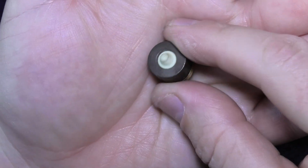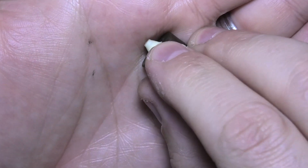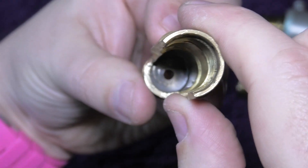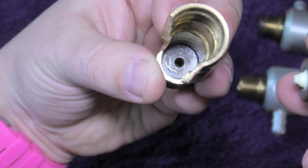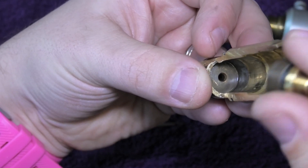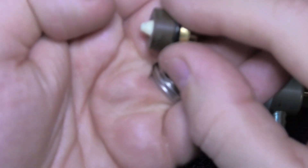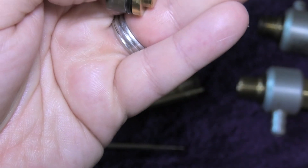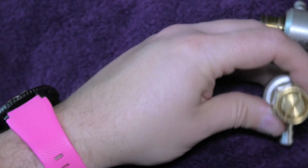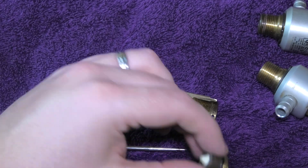So you've got this little ceramic piece here. I haven't figured out the exact reason why mine's not working, but I would imagine it is something to do with the seat — because it sits inside this little brass hole. Obviously because of the pressure, and every time you're on and off the trigger, this will basically pulse just to let a little bit of water out of that relief valve. You may find that this starts to wear around this edge, which may cause seating issues so that you can't wind it in all the way. Because you adjust these by screwing this in, it's only got a maximum amount before it bottoms out, which would be your maximum pressure.